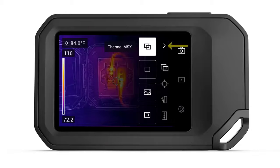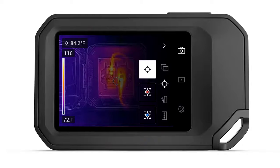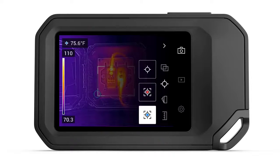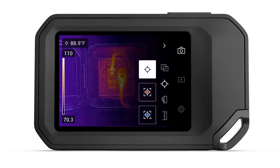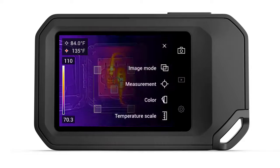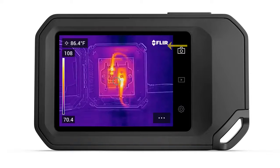To return to the main menu, click the arrow in the upper right corner of the display. The measurement option offers three different temperature measurement tools, including a center spot tool, a hot spot box which provides the maximum temperature inside the display box, and a cold temperature box with the minimum temperature value. Simply touch or toggle the icon for whichever tool you want. Multiple tools can be used at once, and sizes of both the hot and cold spot boxes can also be adjusted. Let's select the center spot value. Click the arrow to return to the main menu — the measurement value for that spot will be displayed in the upper left corner of the screen.